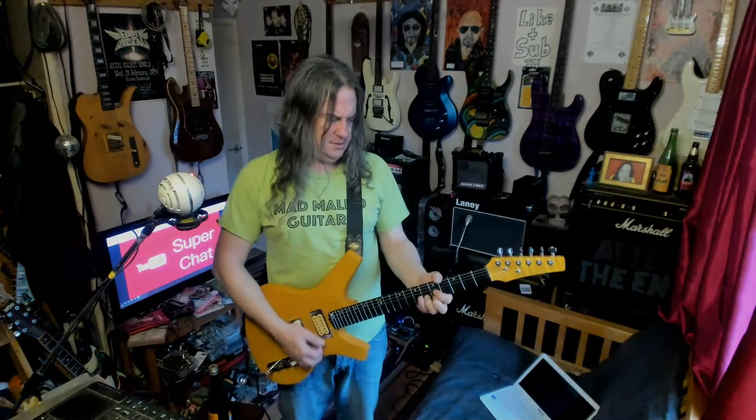Kind of mad. And then you just stick other things in it, but you've got the basic circuit. So you've got a pickup, a wire coming from the top, a wire coming from the bottom. One goes to earth and one goes to the hot, and that's it. And it doesn't matter whether it's the other way around. It does matter if you've got two pickups, because if one of them is backwards, it'll be out of phase, but that's it.